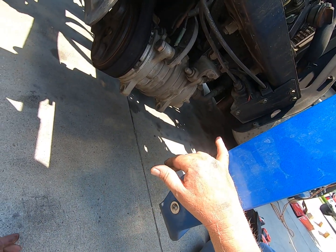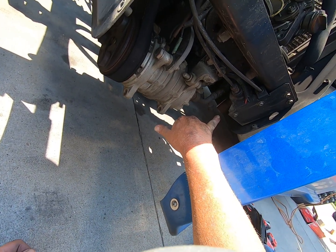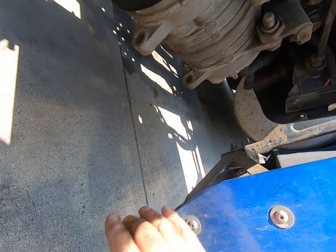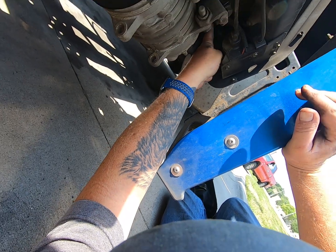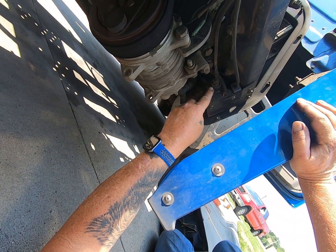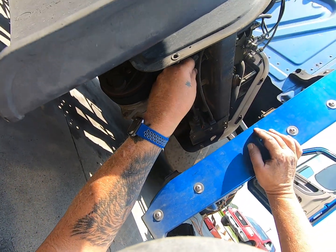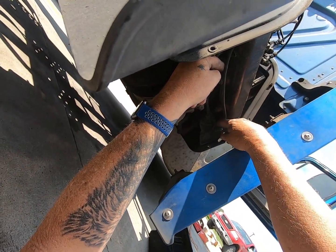And when you do put it back on, make sure you get it tight, because it'll leak from there. And then you'll lose prime in your line coming in, because it comes right in on this back side. That's where the line is going to the fuel tank. And then it comes through into your electric fuel pump. It pumps it into your filter here, and then this is your return. That goes back into your pump again.